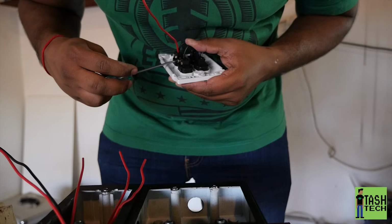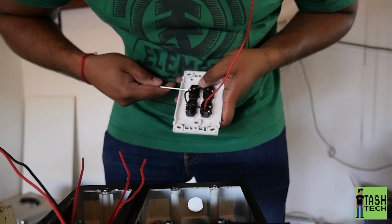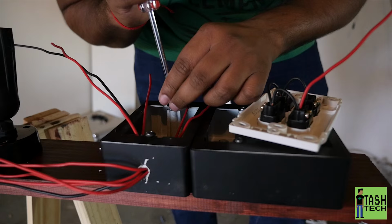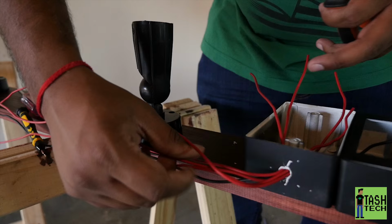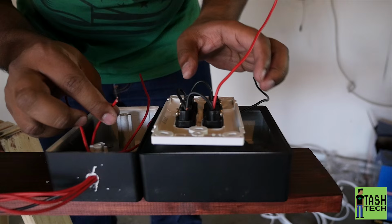And then that longer red piece will connect to the plug point. And then each cable here will be connected to a switch. And then that black cable on the common ground will go directly into the incoming cable, the incoming power, the ground. And just hold them through, I'm snipping them off, making sure they're not too long, because it's left to be tucked away in there. And boom, there's one. Gotta keep your orientation right here as well.